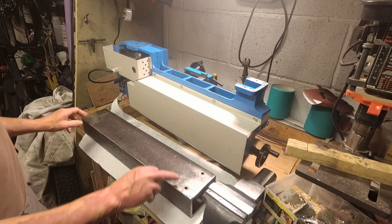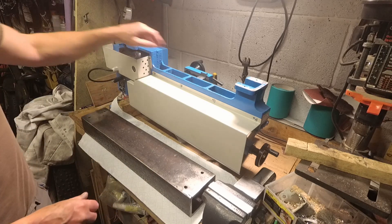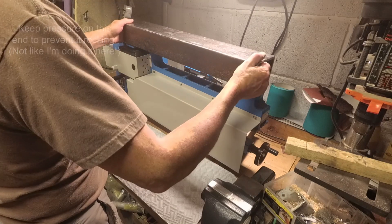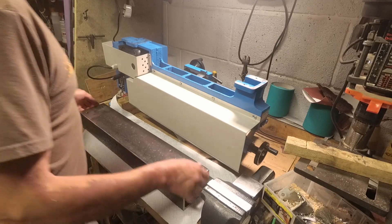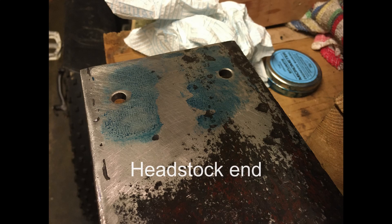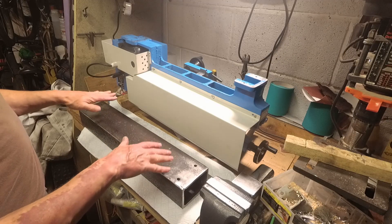The best, truest surface turned out to be the scabbiest one as well. So I've been filing the mounting feet - I've blued them up, been lifting the lathe on and off, and given it a little scoop around. Then using the angle grinder with a sanding disc to start, then the file, just to get a true surface across each end, so that I'm not twisting the bed as I bolt it down.